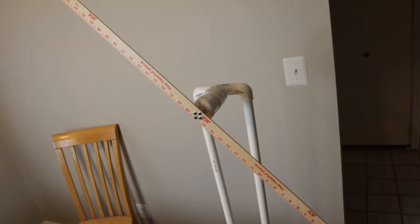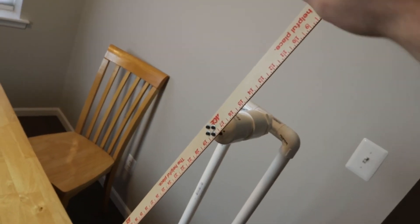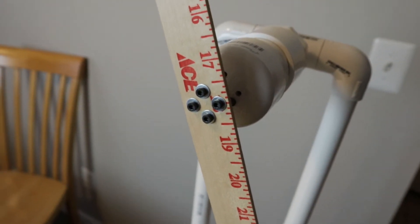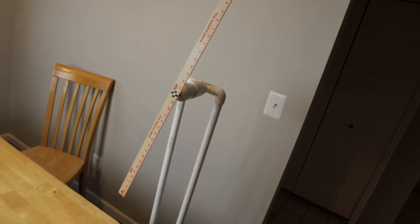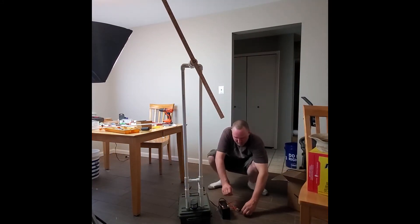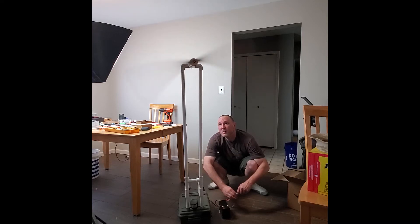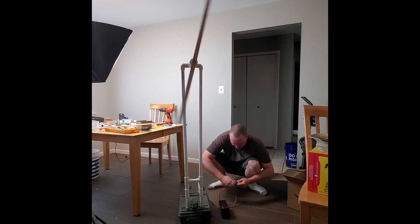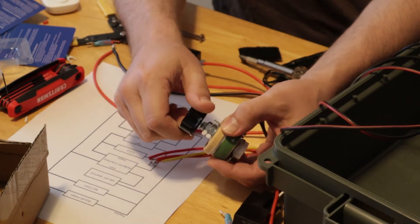Next, I had to think of something to use for the rotating arm. My original idea was to spin ropes, tassels, or something like that, but I realized I needed something rigid to keep them away from each other to prevent tangling. I needed something rigid and flat but somewhat lightweight. A cheap yardstick ended up being the perfect dimensions and weight. With the motor installed and the battery charged up, it was time for my first test. It became immediately apparent that the drill motor was much too powerful for my application — I want something to spin and scare off a bird or squirrel, not vaporize one instantly. So I incorporated a basic rheostat speed control into the circuit.